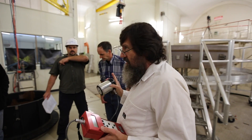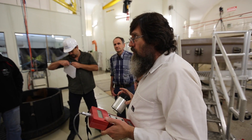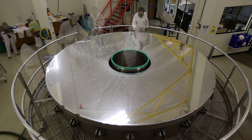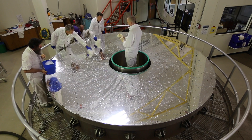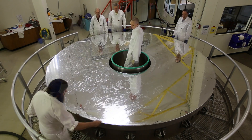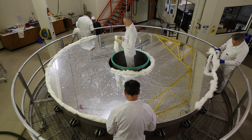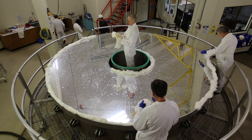There was only one area at 84% reflectance after cleaning, and only one spot; for the majority it's around 75%. The mirror is then washed to get all the bugs and dirt and things that have fallen on it off. You check the mirror reflectivity again. The reflectivity is usually not down all that much — it's mostly dirt and extra scattering that comes off, and that is the biggest problem.